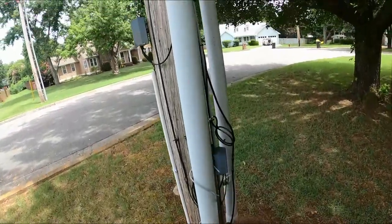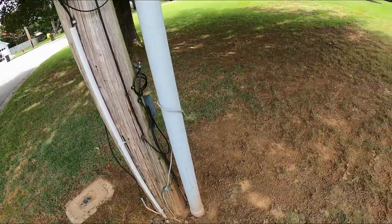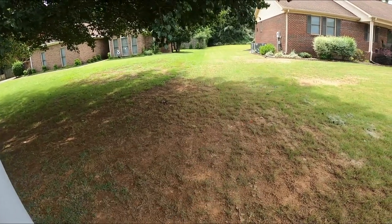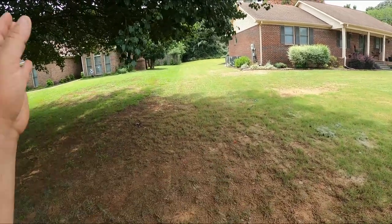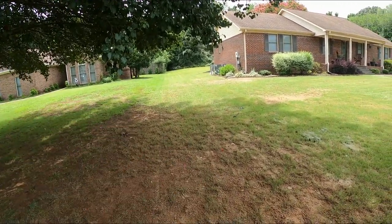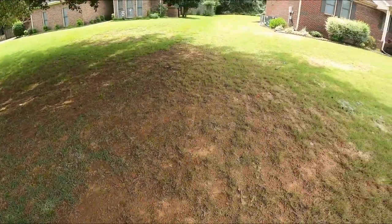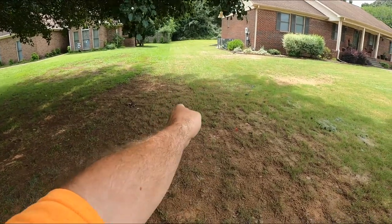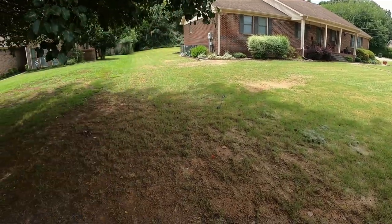Electric's got PVC pipe, 4-inch pipe going up it. Well, you're thinking, oh, it's got to be conduit all the way there. Well, not always the case. There are certain subdivisions where I live, like Southeast Huntsville, where it's direct buried. They don't have conduit. They literally took a trencher out and trenched it all the way to the house. Well, if there was a stump or a root right there, you might have it go off like this and swing out, and they run it to the house.